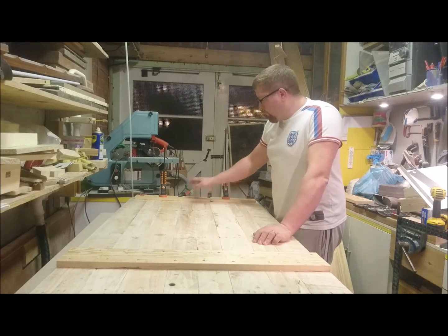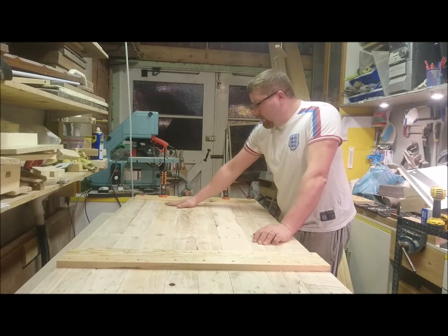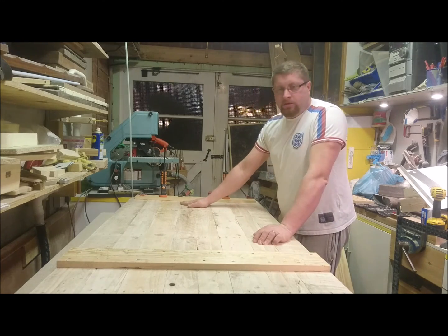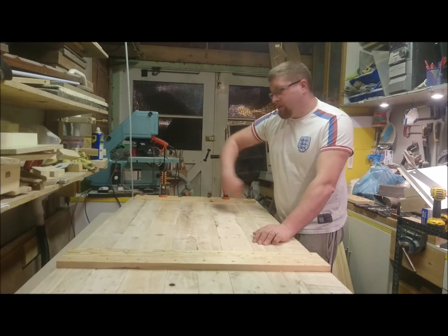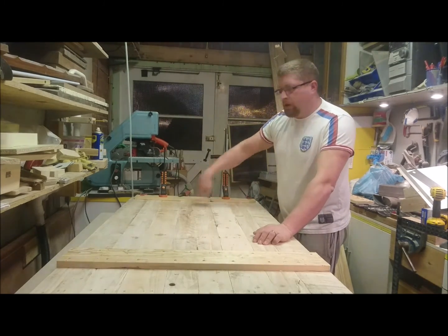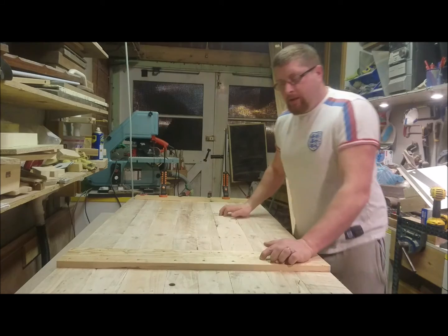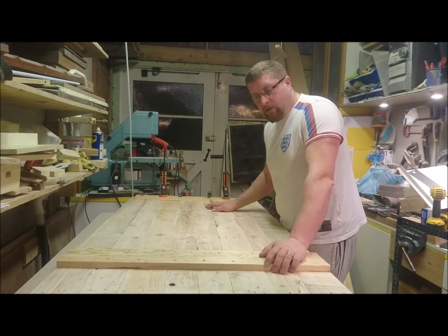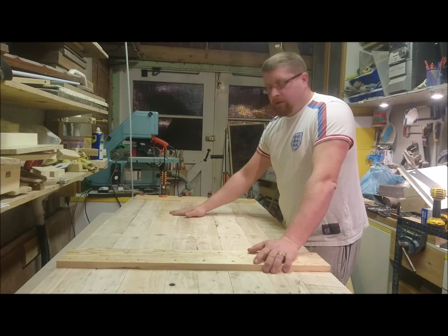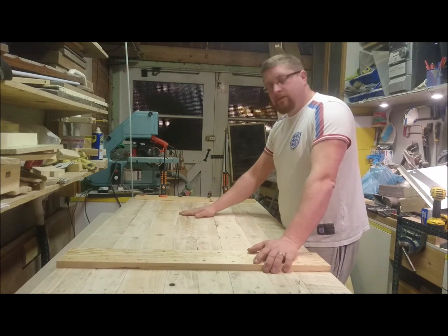That's all done then. I've clamped the top together so it's nice and straight. Those will dry in a few hours. I've left the top brace off at the moment because it'll be in the way of the jigsaw when I cut the arch out tomorrow. The middle and the bottom braces are already on, so it's already nice and solid, and just needs finishing off at this top end.